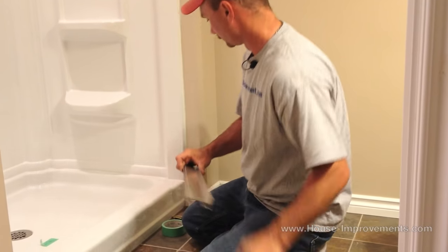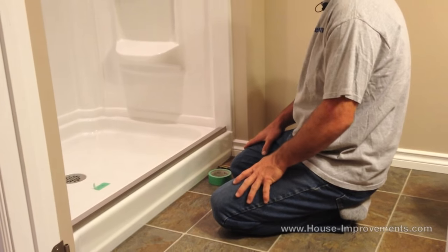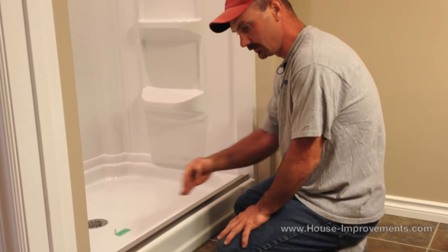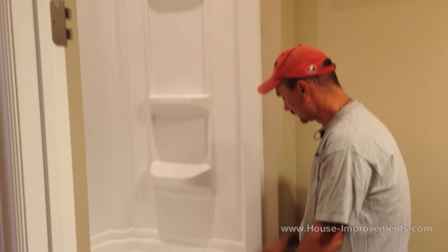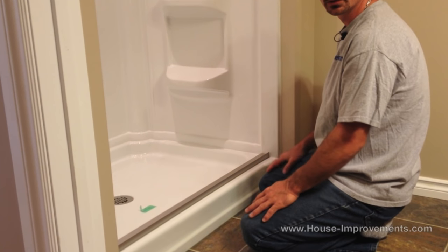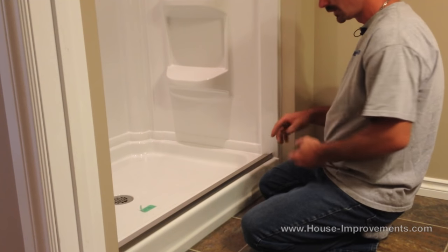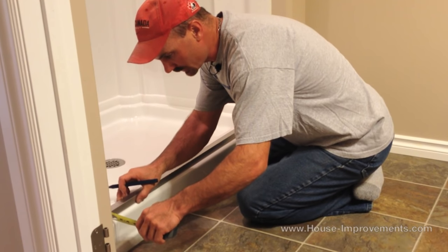So we have got it cut to length. I am just going to set it in on here and you should have room like that to slide it side to side because the side pieces actually fit down between there — that is why they recommend cutting it shorter. What I am looking at here is I want to put it straight across the threshold of the shower. I also want to make sure that the side pieces are on that flat area and not hanging out into the opening. Once you kind of determine where you want it, I am going to measure equal distance on each end and put a couple of little pencil marks just so I have something to go by when we actually fasten it in there. I think I am going to use three quarters of an inch.